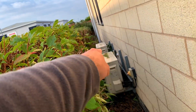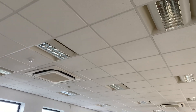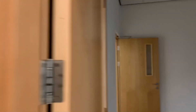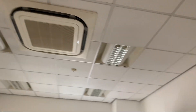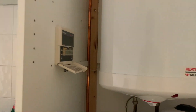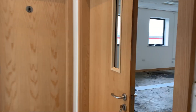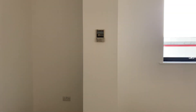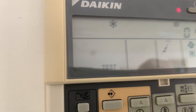There are the other two units. We've got two Daikin cassettes, with remote controllers on that pillar and on that pillar. Then in this little room - looks like a kitchen or staff room - there's another Daikin cassette with the controller in the kitchen cupboard next to the water heater. Exactly the same setup downstairs: two in an open plan office and one in a little corner office. I've put all these units into test mode on cooling to start with, so we'll let that run and see what happens.